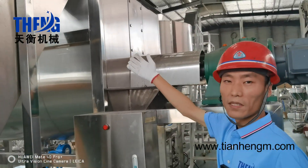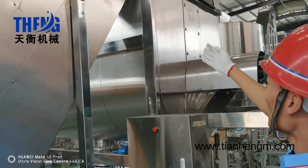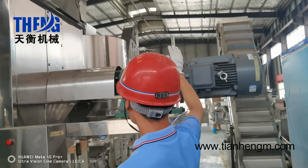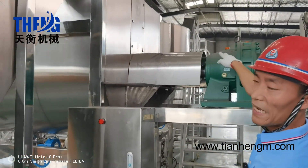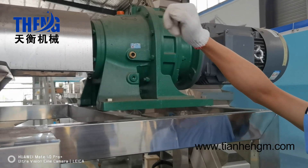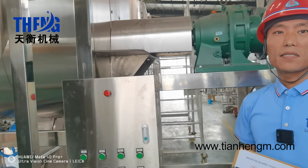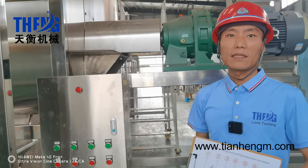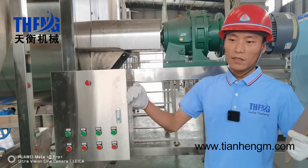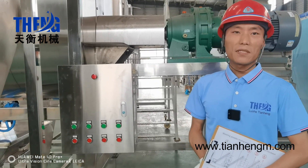This is our powder mixer machine. The capacity is 2,000 liters. The construction is a U-shaped mixing chamber with a motor and a cycloidal reduction gearbox. When the motor is running, it transmits the power to the mixing chamber. The mixing chamber consists of a mixing shaft and a ribbon blender — it is double layer, with an outside layer and an inside layer. The mixing power is not the same for each layer, which makes the mixing very effective and satisfactory.